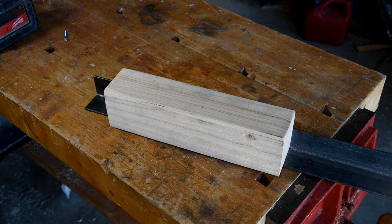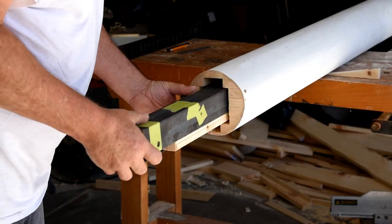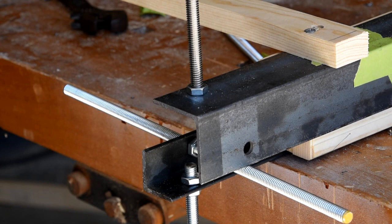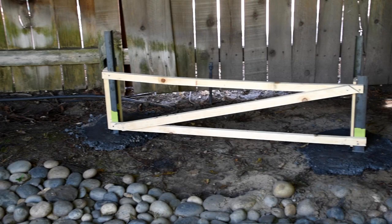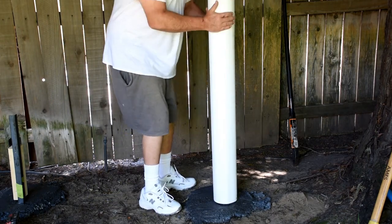To install the gate, we use a couple of steel angle irons separated by a block of wood for each column, sized to fit the hollow openings in the Hashira. We also drill holes in the steel to screw in threaded rods, which function like rebar when set into the concrete pads. Since our location is under a grove of redwood trees, there are a lot of roots that would interfere with a typical deep foundation, so we made a wide, flat concrete pad. To ensure the columns are parallel, vertical, and properly spaced, I built a frame and bolted the steel to it. We then mixed and poured the concrete and set the steel assemblies in place. After the concrete cured, the two Hashira were set in place — with no screws or other fasteners holding them.